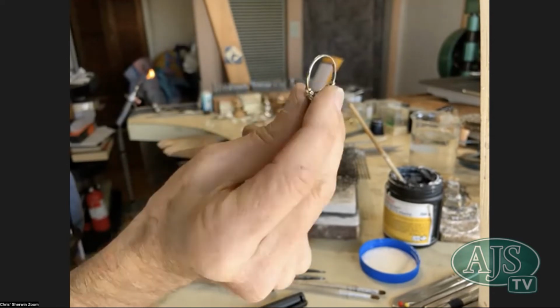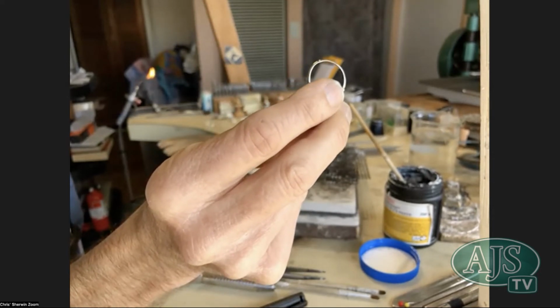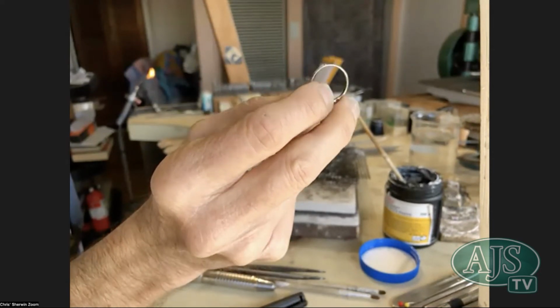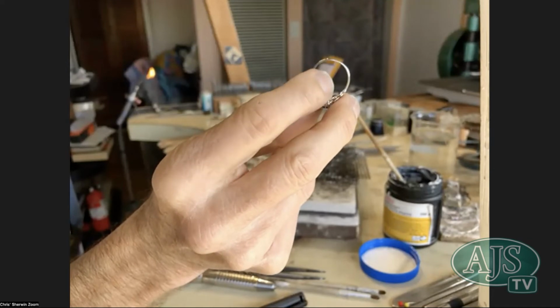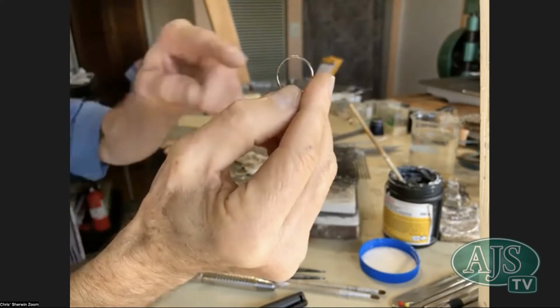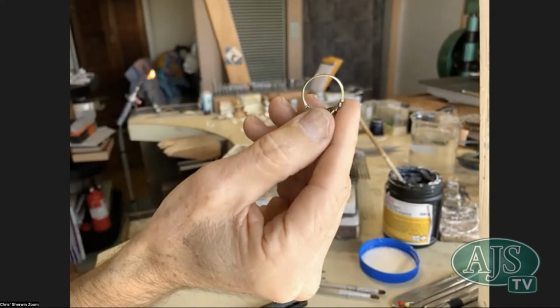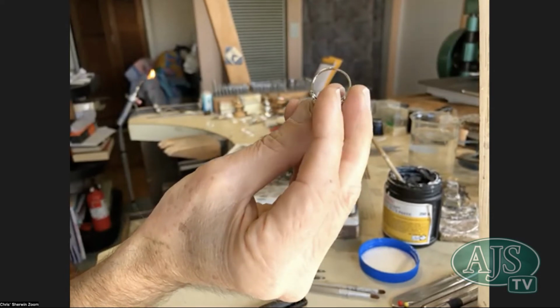Right, yeah. So I cut those arthritic beads out, which I put in about 10 years ago. And in heating the ring up, I could see there are 3 or 4 joins in the ring. So I've completely removed those, and I've added a fresh piece of metal for about 8 or 10 millimeters across the bottom of the band. So it has a brand new 1/4 band on it, that ring. Okay. That's a half round shank.